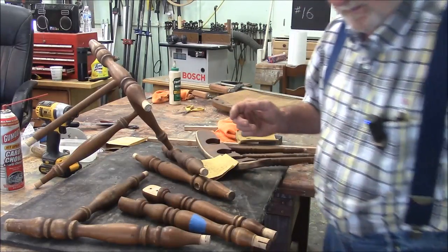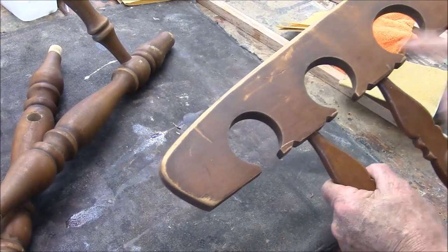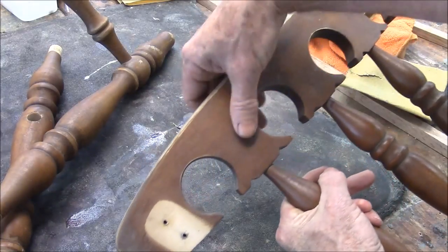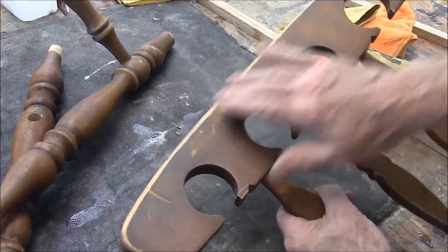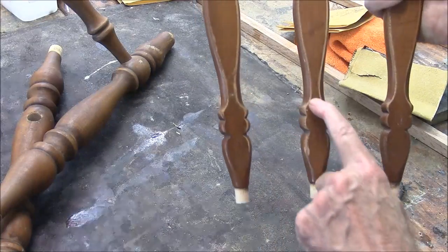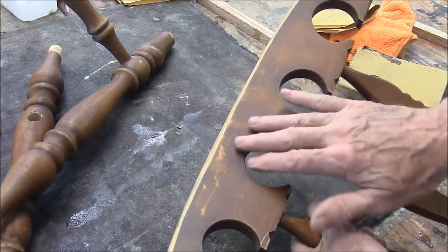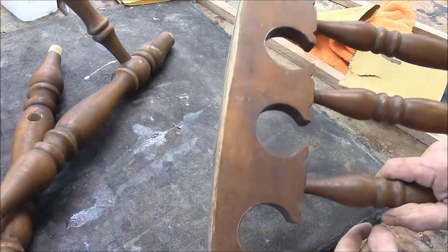So it's kind of a compromise. Let me show you what I mean on this top rail here. You can see the buildup of probably dirt from years of use — people grabbing the top rail. You're tempted to sand all that patina off, but you don't want to do that. That's history — perhaps 50 to 80 years of use and history in that piece. So you don't want to do that.